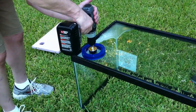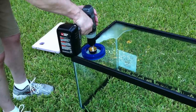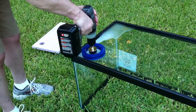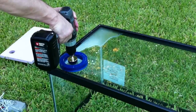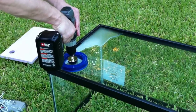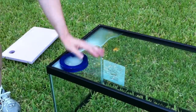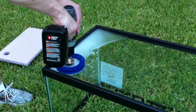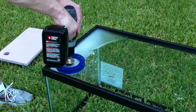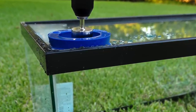Now that the tank has been scored, I can continue the drilling process. The trick is keeping your drill very stable — don't let it lean to the left or right. Ask your helper to keep it focused. If the drill has a level, the bubble will show you if you're drilling straight down. Don't apply pressure or push down; just let the bit gently carve its way through the glass.